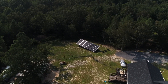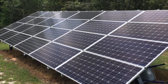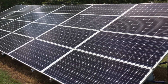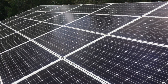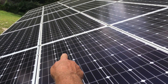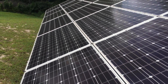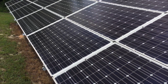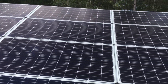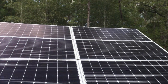Let me show you a little more about my solar array. I have 24 solar panels, 325 watts each. I have two strings of 12 — string 1 and string 2. They're in series, and then I have them going parallel together up to the SolarEdge inverter up there on the wall. I'll show you that in just a little bit.